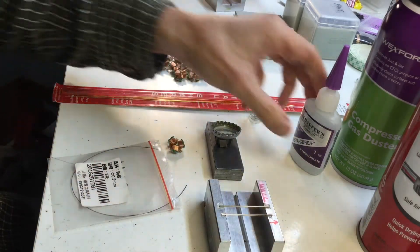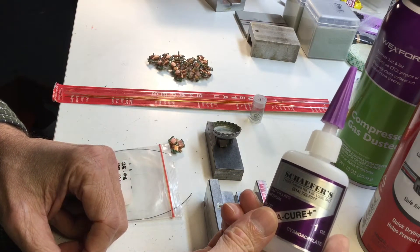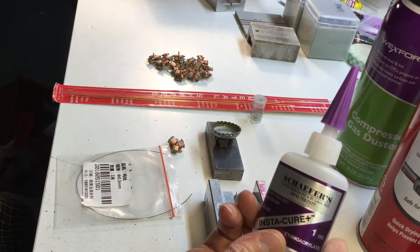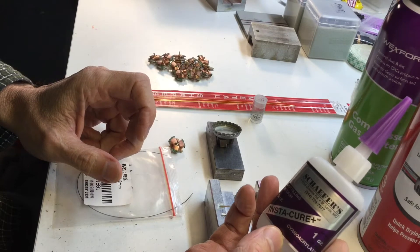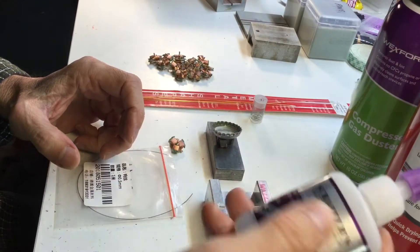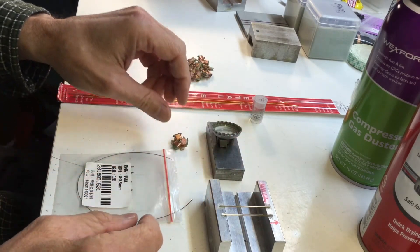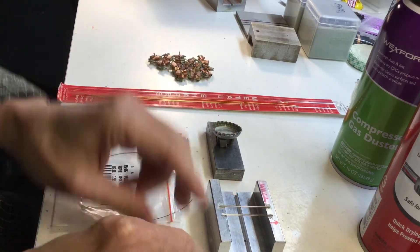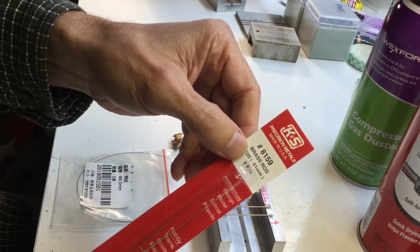You'll need some super glue. I balance by adding weight — some guys balance by removing weight. There's a step later where I will remove weight most likely, but for this part I just add weight. I don't want to cut any more material off the laminations because that removes torque capacity. I'm going to use some balance weights — little bitty ones made from K&S 20-thousandth brass rod, number 8159. You can get this at the hobby shop or hardware store.